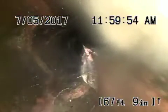This is the six-inch clay pipe we located on Glendale Boulevard. Stop right there — you can see the pipe here is pretty badly broken all the way around. Stop — you can see right here it's completely shattered all the way around. We located this in the street in the first lane of Glendale Boulevard, approximately eight and a half feet deep, and this is pretty badly broken.